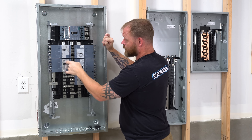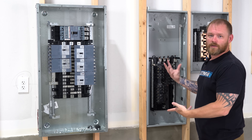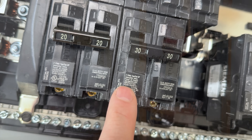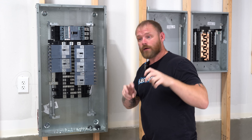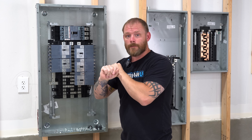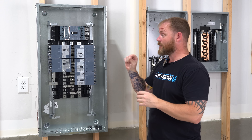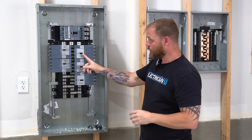This is a 20, this is a 100, and this is a 30 — they're all the same size, kind of like it is over here. Most of the time, if you have a 2-pole 20, 2-pole 30, 2-pole 60, 2-pole 80, it's always going to be the same size breaker. In a panel, we have a handle rating — we say it's a 20 amp breaker, meaning whatever's printed on the handle is the maximum amount of current that breaker can handle having sustained current going through it. A 20 amp breaker is meant to have 20 amps of current flowing through it all day long; once we exceed that, it needs to be able to trip — either a thermal trip at about 120 to 130 percent of that current rating, and then we also have to have short circuit protection.